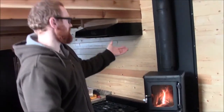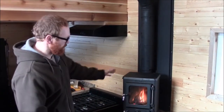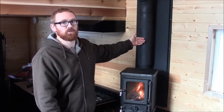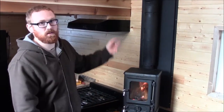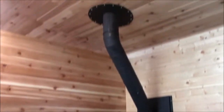So I just want to talk about the chimney pipe. This is Elvent. Normally with a wood stove, to code here in Canada you need a Class A chimney — stainless steel on the inside and the outside. But we did some research and the Hobbit stove is only about 20,000 BTUs, and right on the back of the stove it says the flue temperature is 258 Celsius. This Elvent is generally used for pellet stoves and is rated for 300 Celsius. We're on a trailer so there's really no code we have to follow, but it should be completely safe — the temperatures will be under what it's rated for. This pipe is double-walled, stainless steel on the inside and galvanized on the outside, and we've painted it.